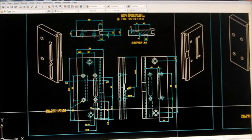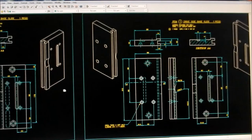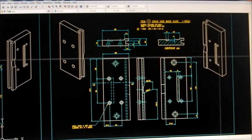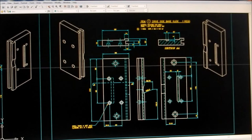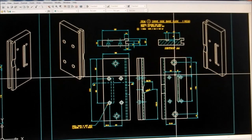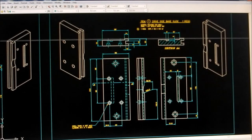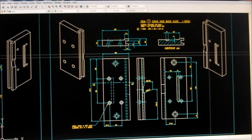I've got another two holes that I'll need to drill and tap to mount up the other end. That's the operator side — the side closest to the lathe — and this is the side closest to the tailstock. I'm not going to put the keyway on this side as it doesn't need to transfer any loading. We'll just do straight machining, drill and counterbore to mount that in. It'll mount up against the side there as a reference but there won't be any impact load coming onto this slide base.